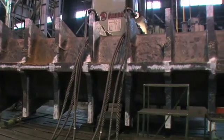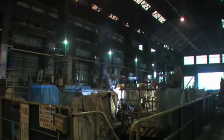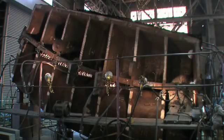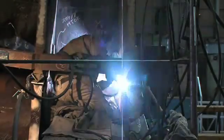The saddle then heads back to the foundry for hand shaping and grinding of the exterior surfaces. The saddle is tested using ultrasonic technology to check for imperfections, and weld repairs are made to refine the saddle after ultrasonic testing. Structural welding then attaches steel plates to the cast saddle section. The temperature of steel must be carefully controlled during welding — the entire saddle must be heated to ensure a strong weld. It takes up to four weeks for welding and attaching plates.